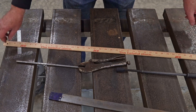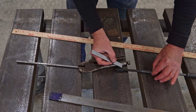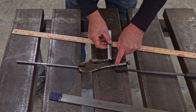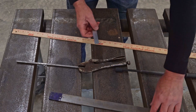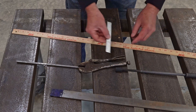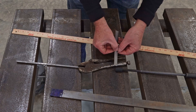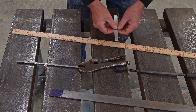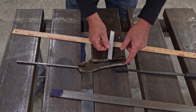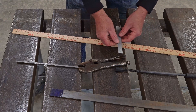Maybe just a little bit closer this way. What I'm going to do is measure the gap on each end. I have a piece of inch and a quarter by a quarter inch thick steel that I want to make a short angled piece of metal that'll go in there and fill that spot, then weld everything together. I already did this measurement and it came up to be three quarters on this end and a half inch on the other.